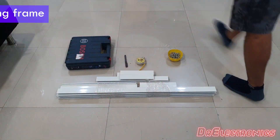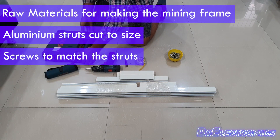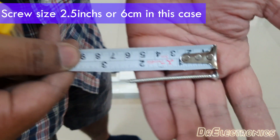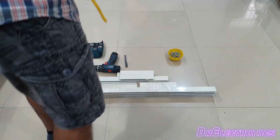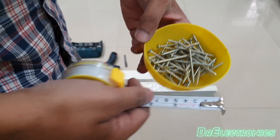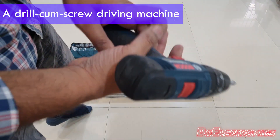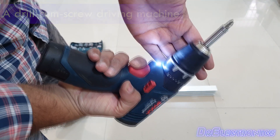Let's get through the list of raw materials. I've used aluminium struts for making the frame structure, and the GPUs will be resting on a wooden block. For this frame, I have used 2.5 inches or 6 cm gypsum screws to hold the frame structure. I did buy 100 grams of these gypsum screws from the hardware store. I already have a measuring tape, and another important tool is the drill cum screwdriver machine. If you don't have a machine like this, you can use a handrill or another alternative tool.